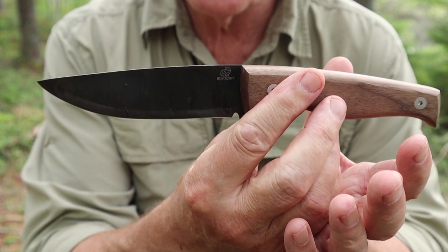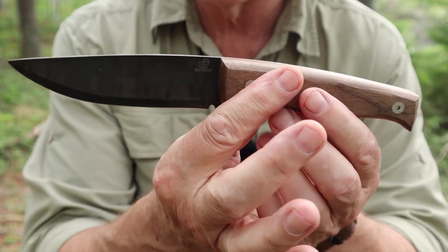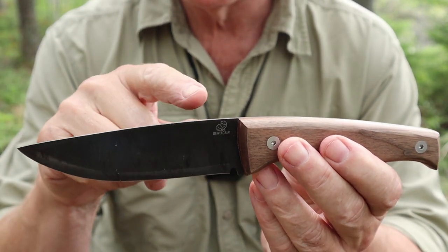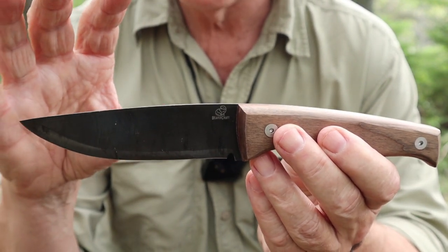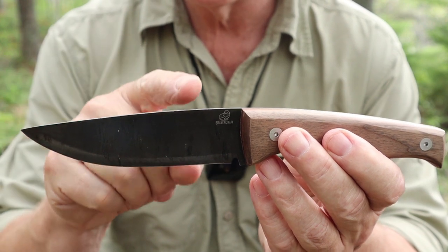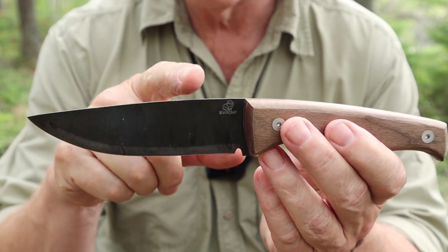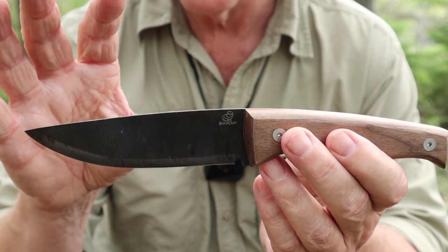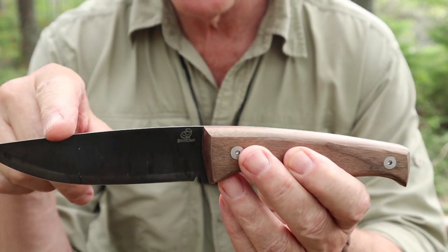This is 1066 carbon steel. Yes, there are steels with much higher carbon content which theoretically will give you longer edge holding, but if they're not well heat-treated they can't take advantage of the better steel. Take an axe — a lot of axes are made of 1045 or 1055 carbon steel and are not hardened to the same degree as a knife edge, because they're meant to take impacts. An axe hardened like a knife would chip out the edge.